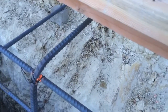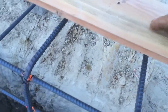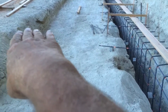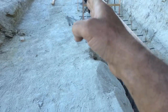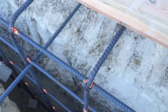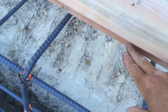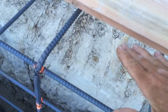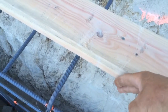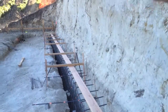As you can see, the underneath part is beveled on each side. For the first pour, they'll pour the footing all the way across and down in the channel, up to the bottom of this two-by-six. So that lower two-by-six is going to create a little channel in the concrete. On each side of the two-by-six there'll be rebar coming up the full height of the wall.